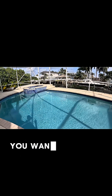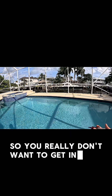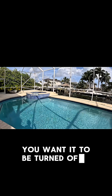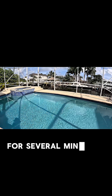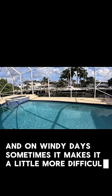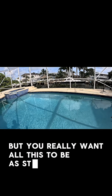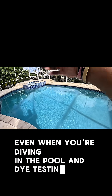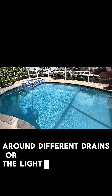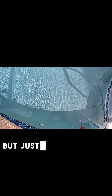When you're dye testing, you really want the pool and spa water current to be as still as possible. You don't want to get in the pool at all — you want everything turned off, the pump not running for several minutes before you start dye testing. On windy days it makes it a little more difficult because the water will be moving. Even when you're diving in the pool and dye testing around different drains or the light, try to keep your body movement as little as possible.